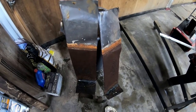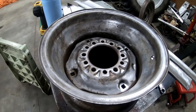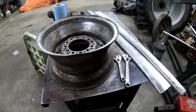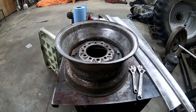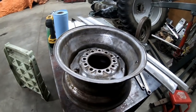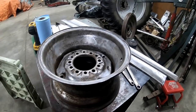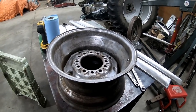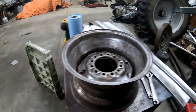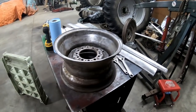They're coming out — definitely a cheap way to go at it if you've got the time and patience to leave it in the tank for a day or so. Probably if you got the electrolyte concentration a little more intense and pushed more amps and voltage through it, it would go faster. I saw a YouTube video where someone hooked theirs up to a welder, made a small frame like a little swimming pool, and did a whole car frame in just a few hours. That's what I'm doing to clean up sheet metal — hope you enjoyed it, thanks for watching.